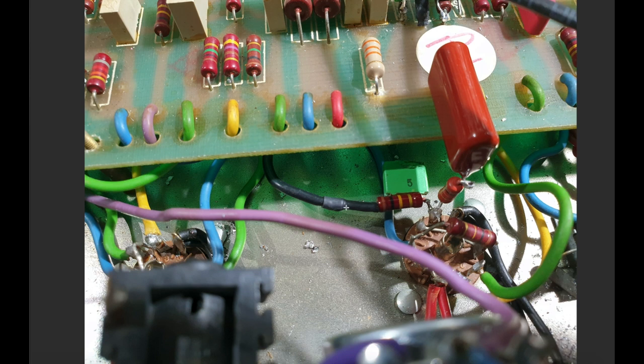And then I've run that off, and that goes to the ground, to the bus ground, which is where the pots are, right? There's that bus ground that runs across to the exact same point where this here was connecting to. All right, so keep all the grounding consistent.